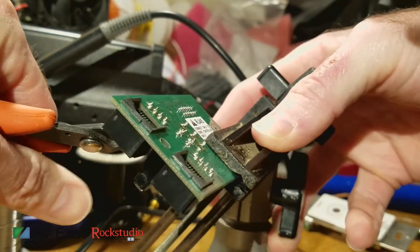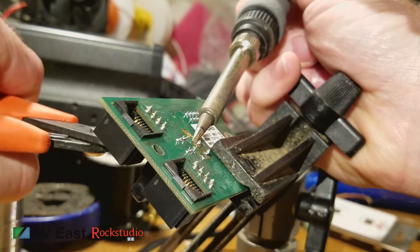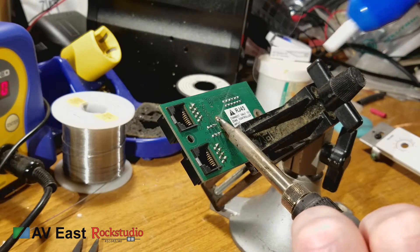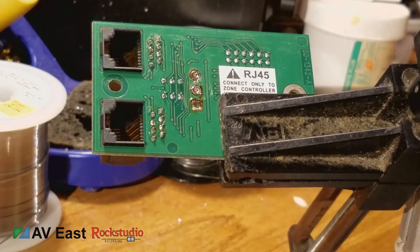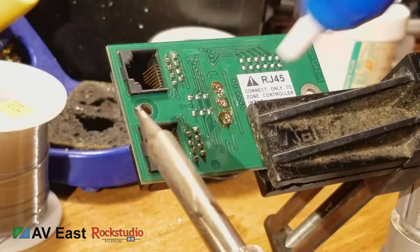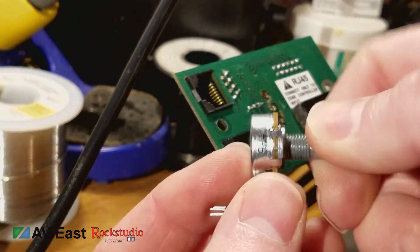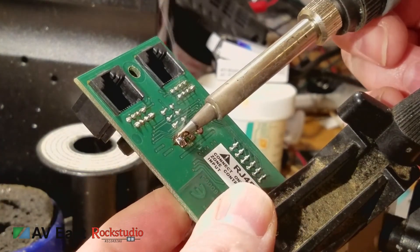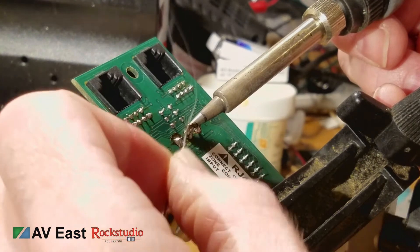Make sure that the solder is melted all the way through so you don't accidentally pull off any copper trace that could be located on the top side of the circuit board. After you've removed all three stems, use a solder sucker to get all the solder out of the holes. This is the replacement pot — it's an Alpha B50K, so it's a linear taper and it's detented. I haven't been able to find the specific part on Mouser, and I've been ordering the replacement pots right from Harman. You can take your time and solder all three legs pretty well. There's no risk of damaging this component from heat — this type of pot isn't really sensitive to heat, plus those legs are really long.